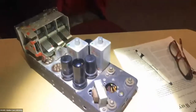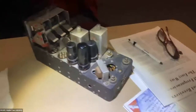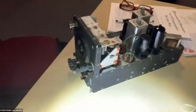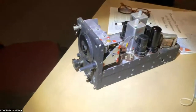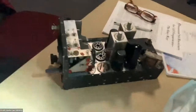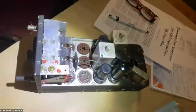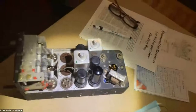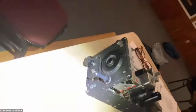I built a new BFO circuit — basically an Armstrong oscillator — and wound a coil on a toroid rather than using the original transformer coil. I got it working; at least the IF was working. Then I came across the very unfortunate discovery that the three front-end coils under the deck — the antenna coil, the RF amplifier coil, and the local oscillator mixer coil — had all been either modified or burned out. So the whole unit went on the back shelf for about three to five years.